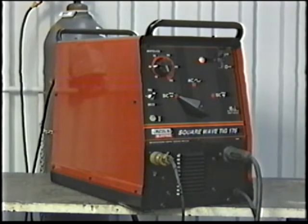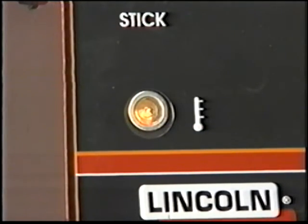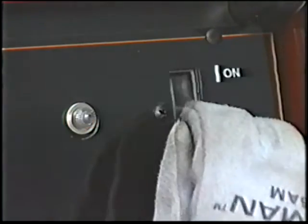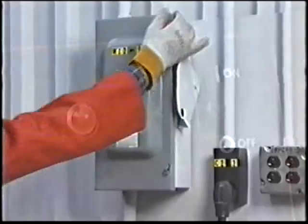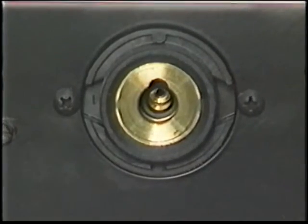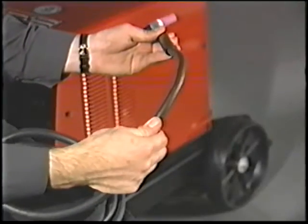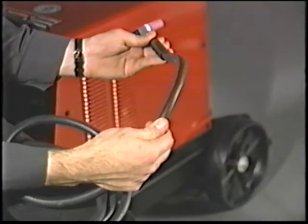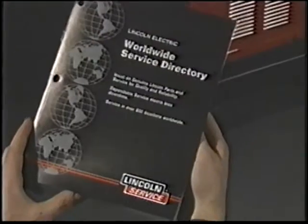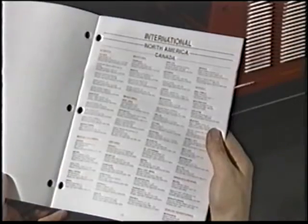Should the transformer in your welder overheat, welding output will shut off and the over temperature light will come on — the fan will continue running. Before performing any maintenance tasks on your welder, be sure the power switch is off and input power unplugged. Check cables for cuts and missing insulation and replace if necessary. Damaged labels or decals should be replaced. Inspect the gas outlet O-ring for wear and damage, look over the torch body for cracks, and check the cable and hose for damage and wear. Replace them promptly when needed for your safety. Refer to the troubleshooting page in your operator's manual, or contact your local Lincoln authorized field service facility.